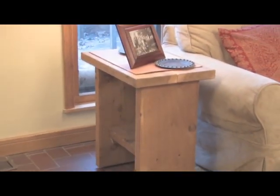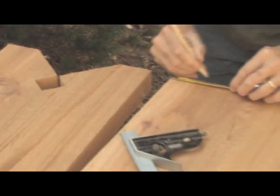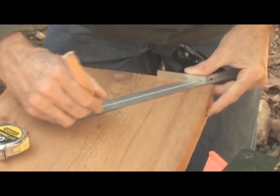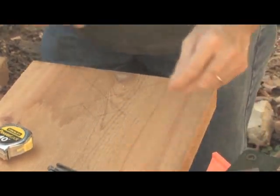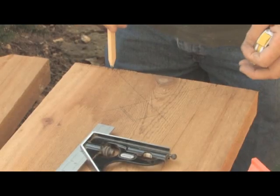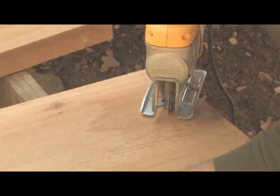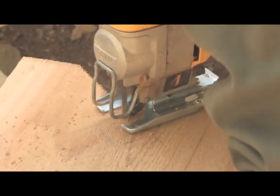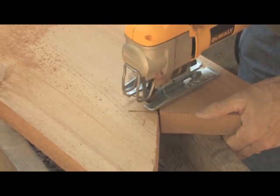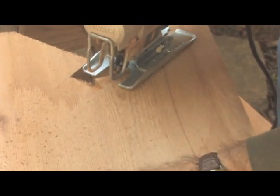You can leave your table very simple, or you can use this as an opportunity to be creative. On this table, I've designed a cutout on the table ends using a jigsaw. The diamond shape is laid out with a combination square. For this particular design, I measure two and a half inches in from each corner and mark the line, then directly from the corners I mark again to form the inside cutout. With a jigsaw, you can make either straight or curving cuts. You can make curving symmetrical shapes with scissors and folded paper.